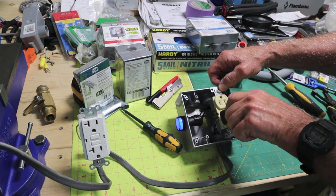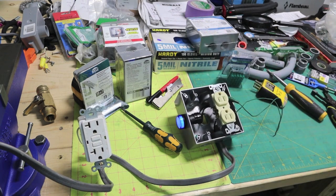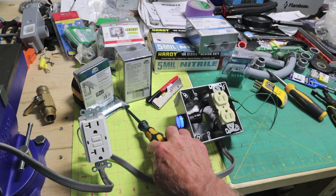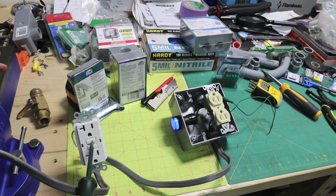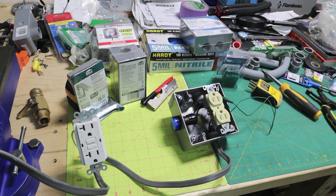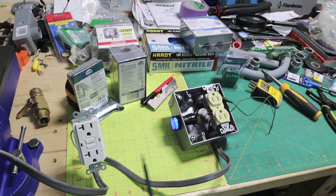If you guys have any questions, don't hesitate to ask. I don't do this for a living — I'm not an expert, not a professional. There are some really good people who know what they're talking about on YouTube, and I watch them and ask questions through the comment section. This is going to give me a GFCI-protected sump pump, but I don't like it — and I'll tell you why. At my house, when I have a lot of thunderstorms with lightning, these GFIs trip, and I don't know why. If this trips, I've lost my sump. You usually need the sump during storms. It takes a while for the water level to come up to critical levels, but according to code and new install, this is what they want. Thanks for watching, stay safe out there.